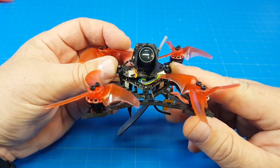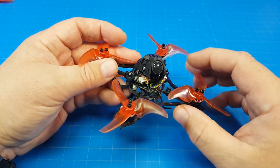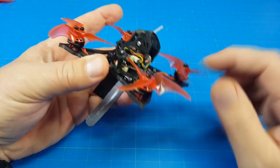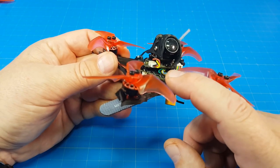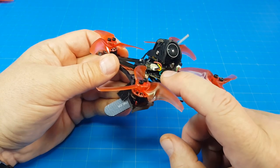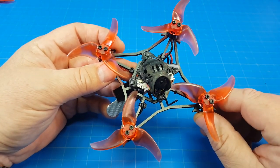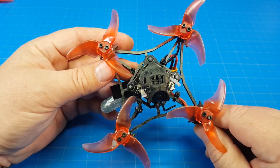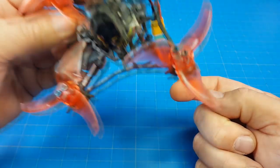The canopy is bowed out on one side from the nylon screws putting stress on it — the canopy is actually holding the nylon screws together, so you need a pretty rigid canopy to make this work. If you have a hard enough crash, you could even break a nylon standoff, which is bad: if the VTX components contact the flight controller, you could get a short. They do route the wires underneath, which gives a slight chance the VTX would come to rest on wires rather than touch powered components in a crash. I applaud the design — it looks like it makes use of a cube-style design.